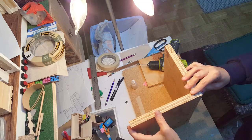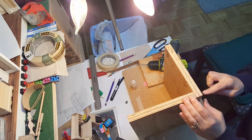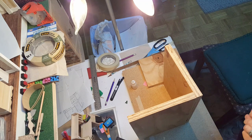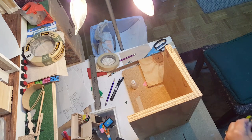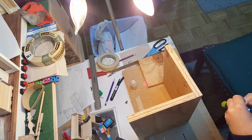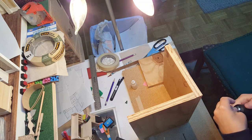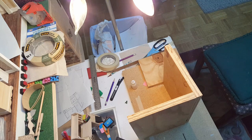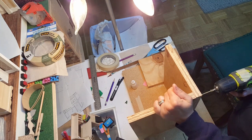I've stood it up like this and pre-drilled one hole here. Now I'm going to remove my drill bit from my drill gun and put a bit on there that fits my screws. Once I have that in, I'm going to attach one screw to just help hold it — going right in the same exact hole.